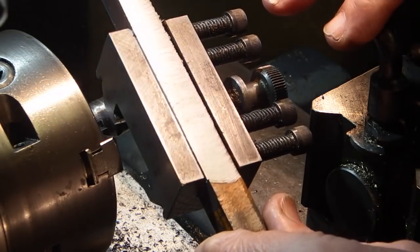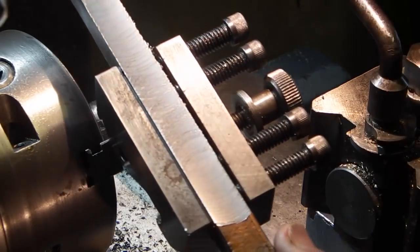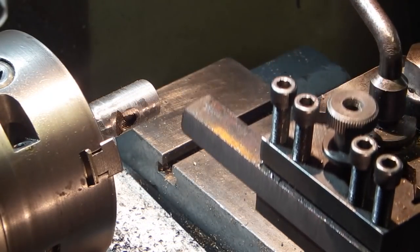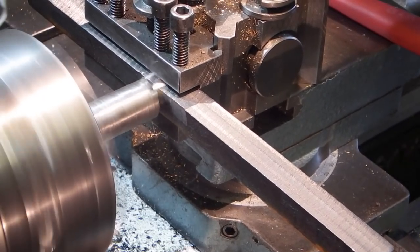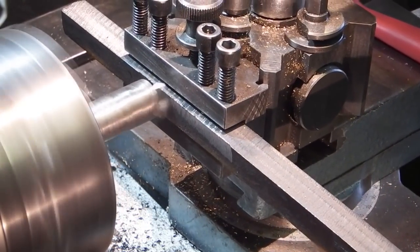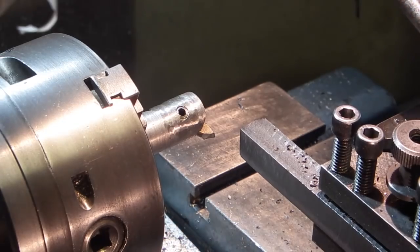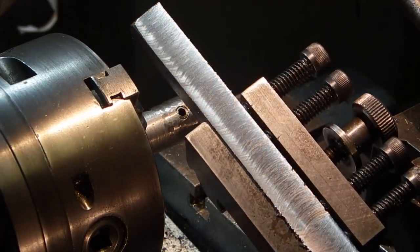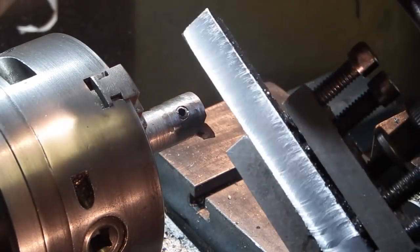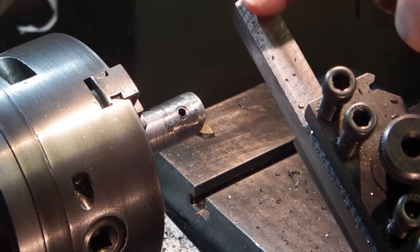There's the second face. When I take this out of the tool holder I'm just filing off the sharp edges, then I'll turn it onto the face I've just machined to do the third face. There's the third side. Now I'm going to take the sharp edges off, put this face down, and mill the last side — the side that was sawn off at the steel mill.